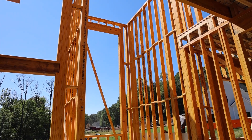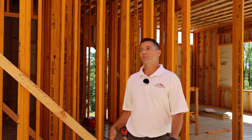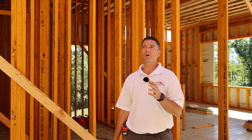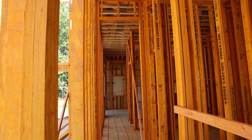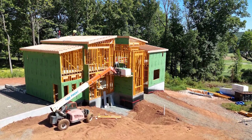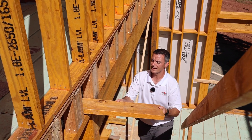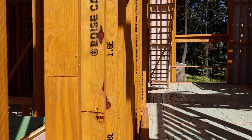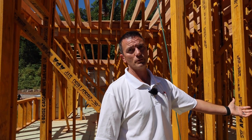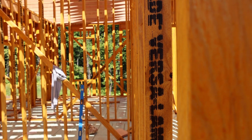This house is a little different — we've got some extremely tall walls. Our first floor is 12 feet, our second floor is 12 feet, and some of these are two-story rooms. To build these exterior walls with traditional two-by material just won't cut it — it's very tough to get a nice straight wall, especially with these large window openings and the amount of light coming through. Any imperfection in that wall is going to show. It made sense to just do all the walls with LVLs. Most people think of LVL as big beams, but on this project all our LVLs are the same size as traditional studs — inch and a half by five and a half. We're guaranteed to have a nice straight wall.